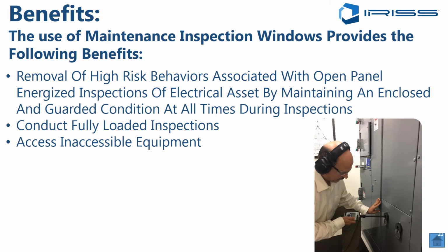We're able to access inaccessible equipment. There are many types of equipment, panel boards are notorious, which are so difficult to do infrared inspection on. It's a three-man operation to remove the front panel from a panel board in some cases, and it's time consuming and it's dangerous because you're doing it on energized equipment.